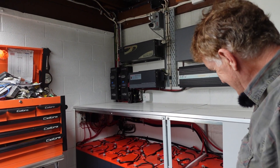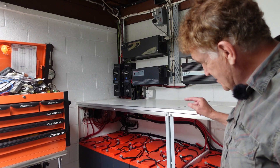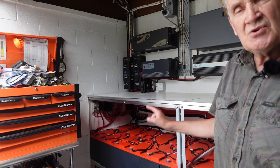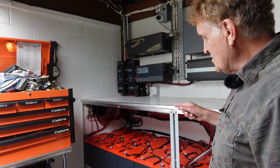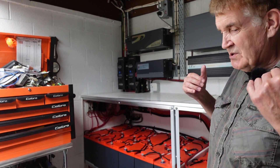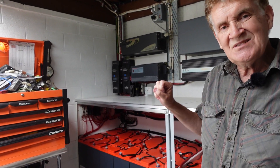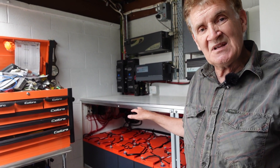That's the setup, and it's been in there a few years now — just ticks away and does the trick nicely. All of these cables here are crimped, but they're also soldered. It's super important with batteries to always solder the crimped joints, because if it's not quite right and you're drawing maximum current it can start a fire. When you sweat the solder into the joint, even when it is crimped — and yes, crimping works 99% of the time perfectly well — when dealing with battery safety, my advice is to always sweat some solder in to make sure you've got a good contact. I also used a thermal camera on here to make sure there are no hot spots anywhere, because that is a potential fire.